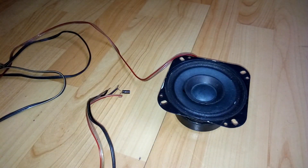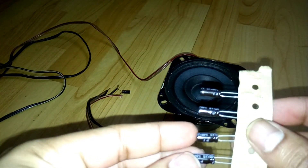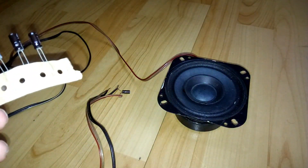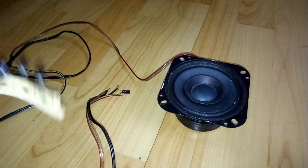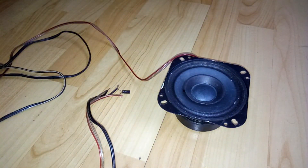So this is it, guys. It's just a 100 volt 4.7 microfarad capacitor and it's very cheap. You can use it when you need high frequencies, like connecting to tweeters, and you don't have a proper crossover. So you can use this as a crossover. That's it, guys — thanks for watching!